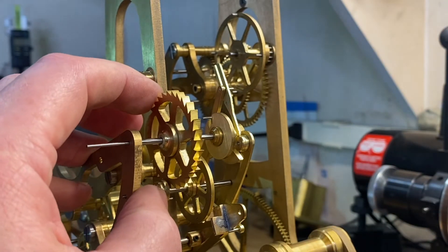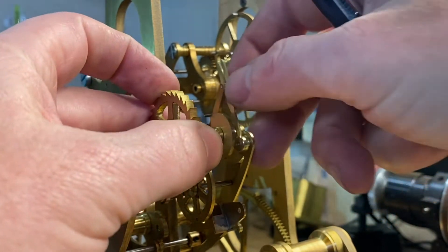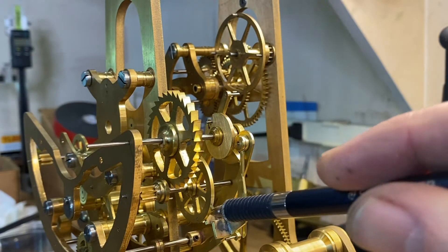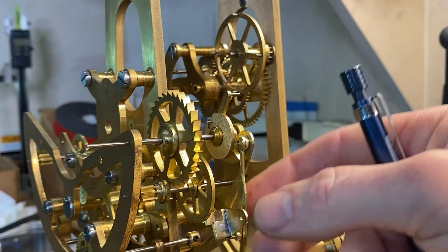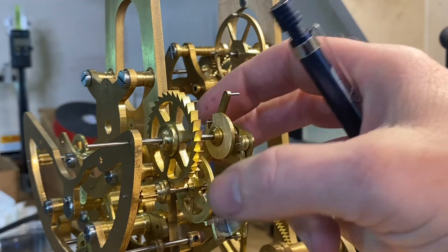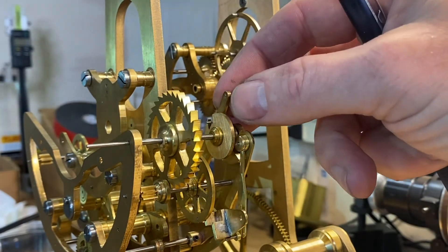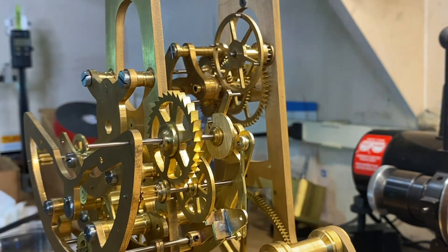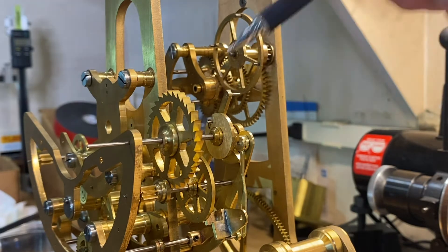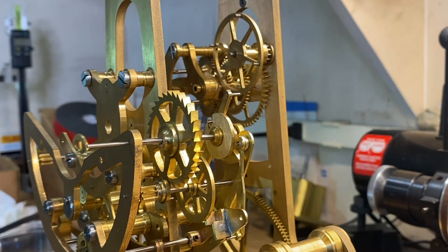That shows you one day. What happens when that lever gets down into that slot — I'll try to replicate it and force it down in there — that slot gives the height of this piece. What I need to do is file this edge so that on a 28-day month it allows this lever to drop farther than it does when going into that slot. You can see that lever drops down — it'll allow this thing to sneak around. There's a timing action of when it sneaks around: you've got to catch it on the first, second, or third opportunity depending on how many days you want to skip, and that depends on how far you let this drop down. With these two mechanisms you're able to see what month it is and skip those last days of the month.